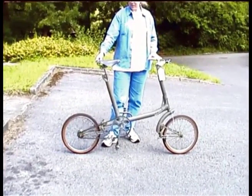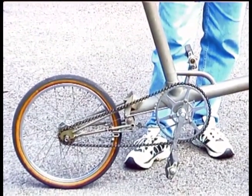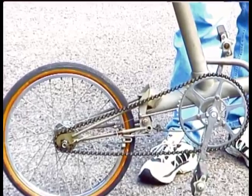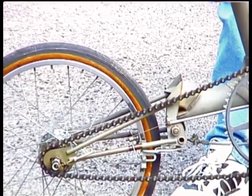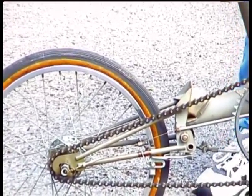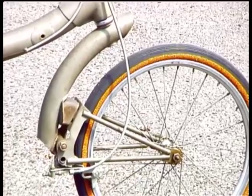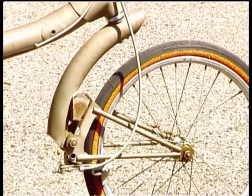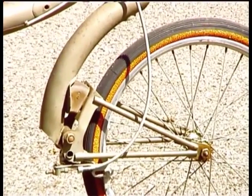So again, if we have a look in a bit more detail, zoom in there, let's have a look at the rear triangle, so to speak. And here you can see that we've got a rubber block suspension, and we've got a rear trailing arm which has very small diameter tubes. Let's zoom in a little bit closer there, and you can see the sort of size of tube there which was later to be used by Alex in the space frame Moultons. It was something which was a bit of an evolutionary dead end at this time, because as we all know, the solution that was adopted on production Moultons was rather different. But you can see that the idea of using thin diameter tubes, which again is echoed at the front end, was present. And look again at this front end suspension. Here we've got a leading link with rubber in compression in a clapper box arrangement. Very different from what happened in the production machine. And again, nonetheless, very much part of the Moulton pattern of front suspension, which was to be conserved on all later designs.